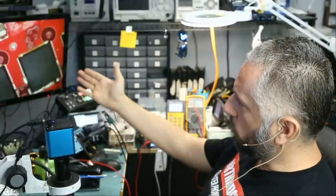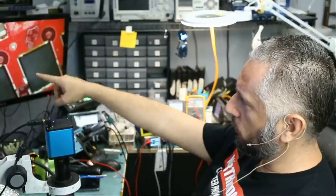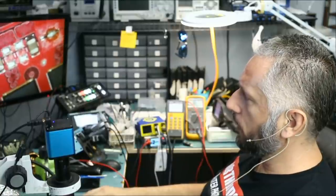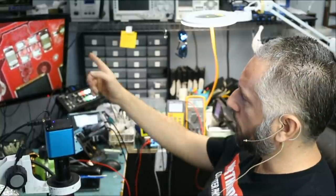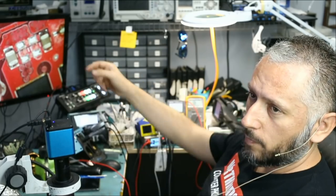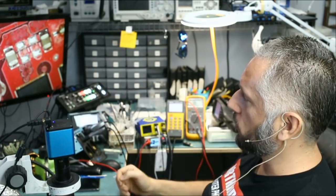So how do we know which component is causing the short? Right now I suspect that one of the two capacitors on top is causing the short. I can easily use our hot tweezers — remove cap number one, and if it's not causing the short, I'll put it back and remove cap number two. That way we can find out which cap is causing the short.